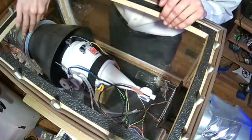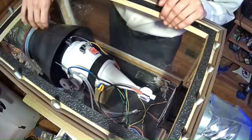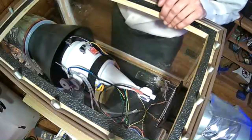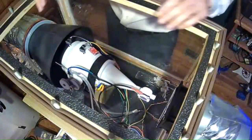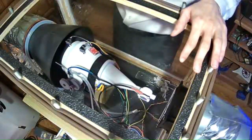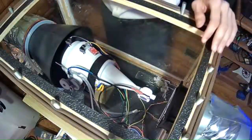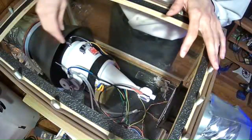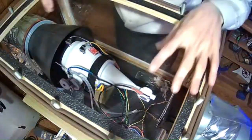And so I have a 1 to 3.02 ratio diffuser here. And this is a 15-degree half angle, so 30-degree complete. And I could talk about the efficiency. I can't really remember offhand about the efficiency of this diffuser, the static recovery efficiency. However, that means that now I can take this speed and reduce it.